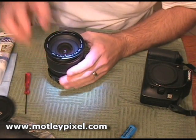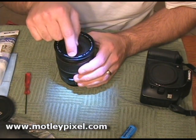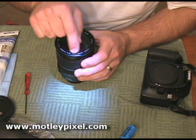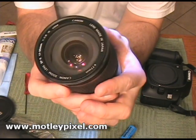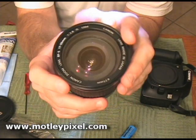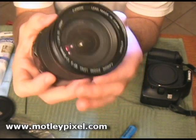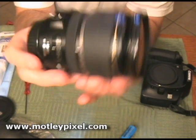I applied the thin bead of silicone and laid the ring piece back in there. Don't be afraid to get your fingers on the outside of the lens — you can clean that later. Just give it a nice gentle tap down so you get good contact on the back side with that bead of silicone. There we have it — a little smudgy and dirty on the outside, but you want to let this cure at least 24 hours before cleaning the end of the lens with a microfiber cloth. All in all, not that hard of a procedure — you just really need to pay attention to detail. Thanks for watching this tutorial on how to clean the dust out of your Canon EF-S 17-55 F2.8 IS USM lens.